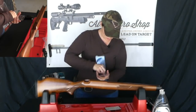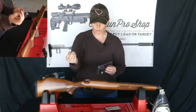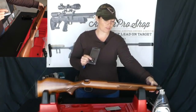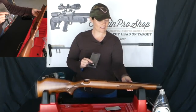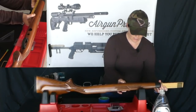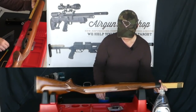I've got another set of wood screws because this only comes with one wood screw, and then the other screw actually screws into a nut right here. But the stock is so thin at the front of the gun that it's not going to work. I'm going to go about 12 inches back because the further back you get, the thicker the stock gets, and I want my wood screw to have something to hold on to.